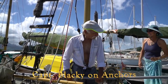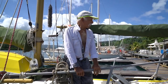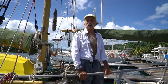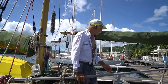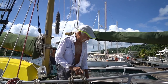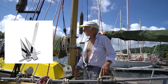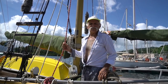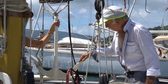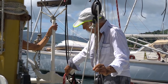Why do you have five anchors? Well, this is a storm anchor — everybody needs a storm anchor. This big 65-pounder here: one time I had to leave an anchorage and I lost one anchor, then had to leave a second one behind. So you never have too many anchors. We have three aboard. People just give me anchors, so I have a nice stainless steel Danforth back there — I'm not that excited about Danforths but I'll use it. And this fisherman anchor here has the kind of flukes that don't jam the line in the back of it.